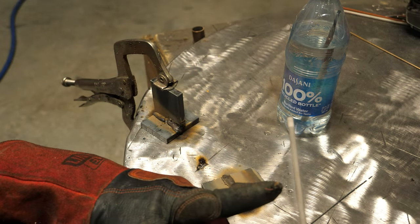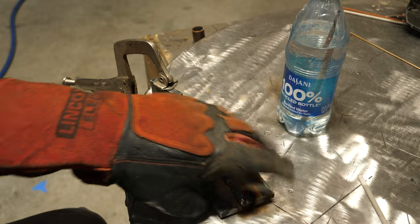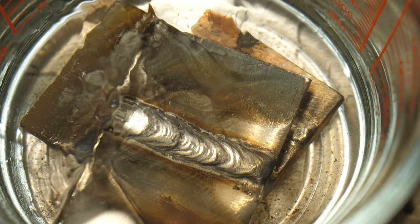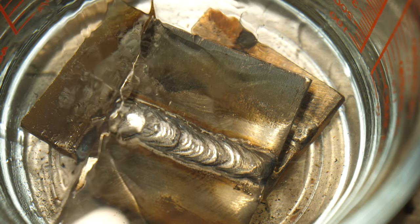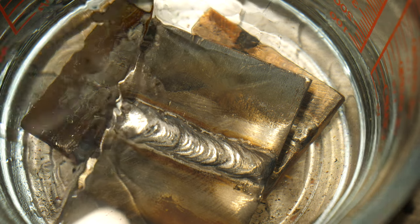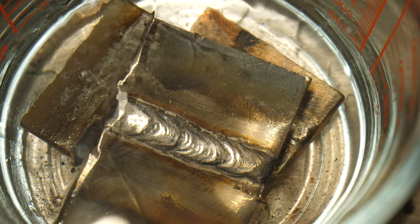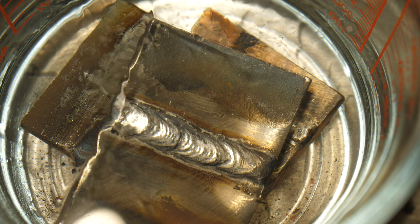You can see how much water is steaming off of this - that's pretty crazy. I'm going to clean this up and throw it into the mineral oil. This is the weld I just deposited and all that white area is bubbles - millions of little bubbles of hydrogen escaping from that weld. There are some heat thermals because the weld and plate are hot, but there is absolutely no question about how much hydrogen is escaping. A normal 7018 weld would not have any of this.